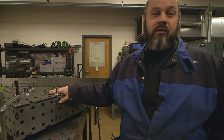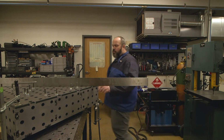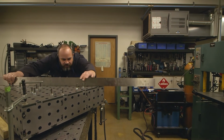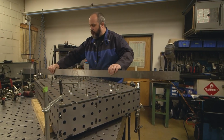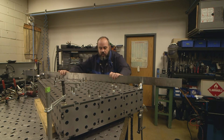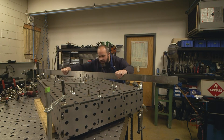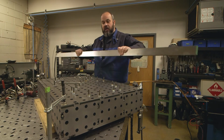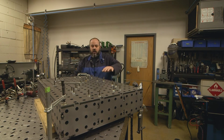Now we got the tabletop flipped over right side right, and we're gonna check it and make sure it's straight. So the way I'm gonna check it, I've got the surface ground straight edge. Now most people probably don't have a surface ground straight edge in their shop. And that's fine. You can use, you know, like a level. Anything that's straight. So I already went ahead and checked it in every way, diagonally, widthways, lengthwise, and this thing's dead on, it's perfect.